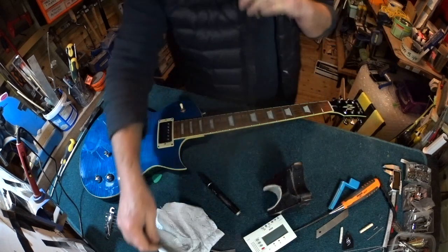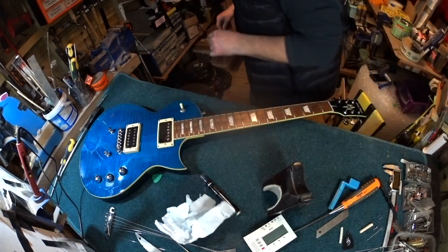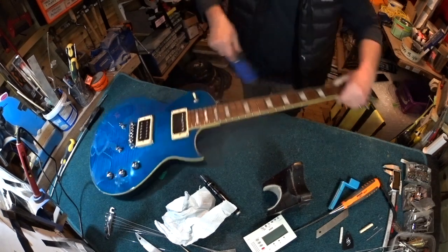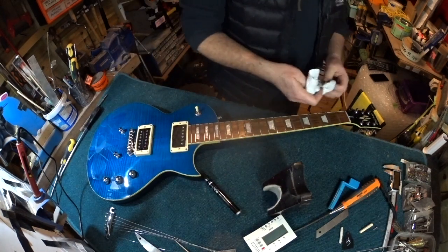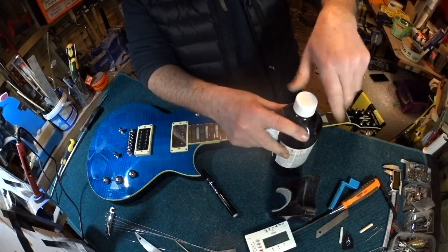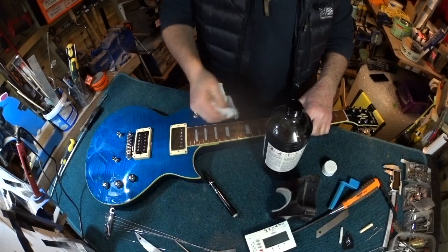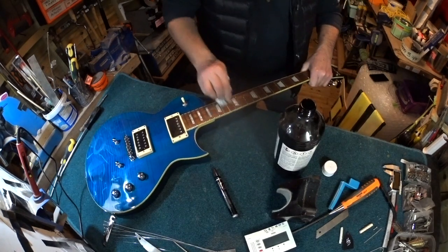the action right. Because the thing you don't want to do is end up giving back a guitar where you haven't leveled out any, you've left some unevenness in, and yet you've set the action very low, and then the customer gets it back and it still has a buzz or something, which isn't great. It's happened a couple of times, and I often realise it's happened because I've wimped out on the levelling. And sometimes it's why I might end up doing a second level on some guitars, where I get it done and then I play it. And then I say to myself, nope, I've chickened out here, this needs a little bit more. And I go back and do it.